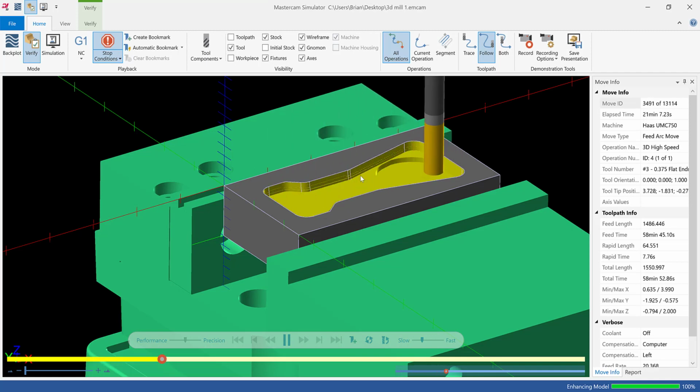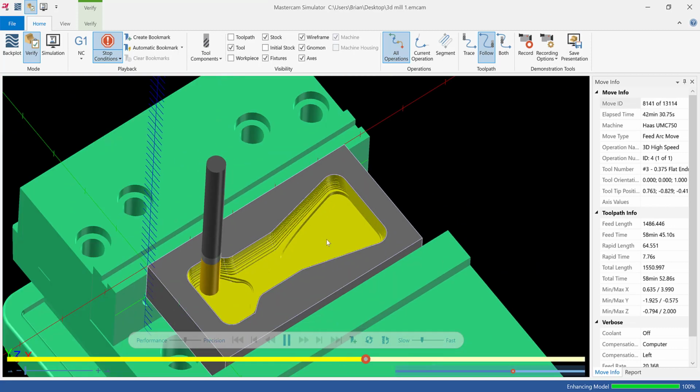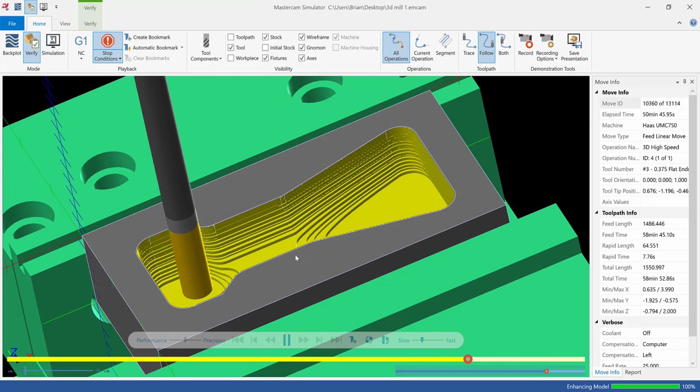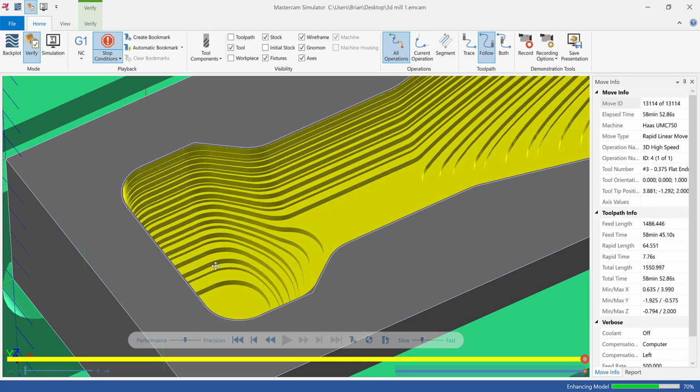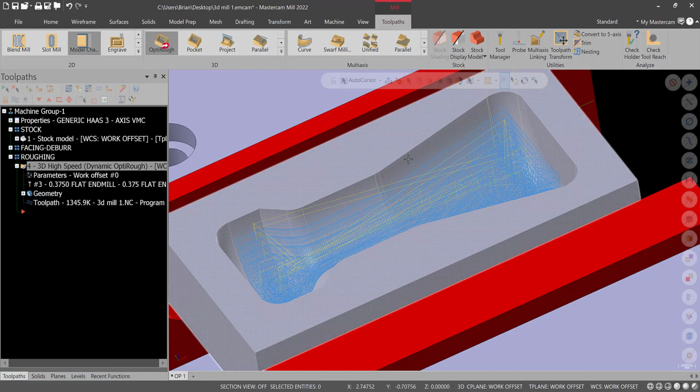And what we're looking to create with our roughing passes is a set of stairs. An even set of stairs along this workpiece so that the roughing tools, you've got to think of it as we're just trying to get finer and finer and finer. We're going to switch to a ball cutter soon, or a ball end mill, to get some of that. So there is our toolpath. Okay. Looks pretty good. Let's hit green check.